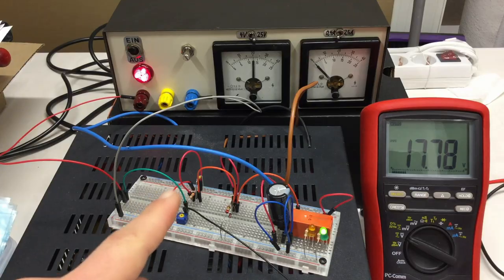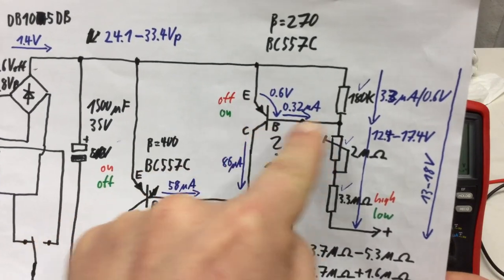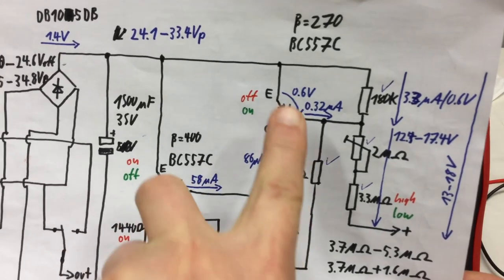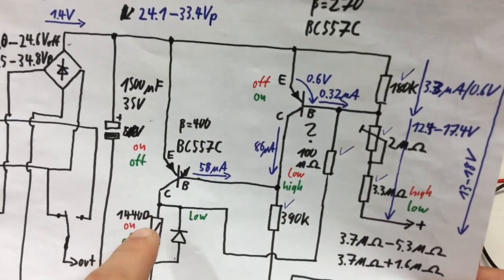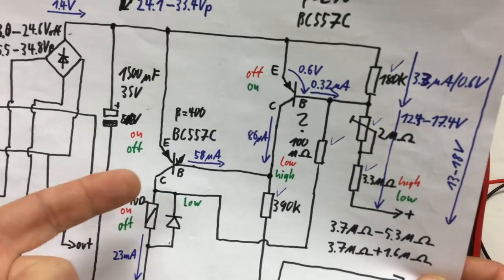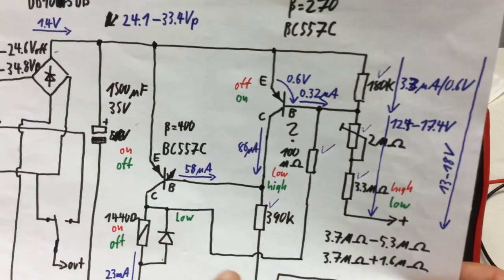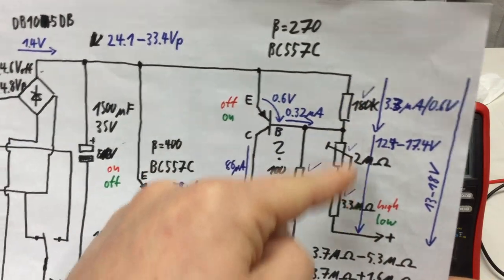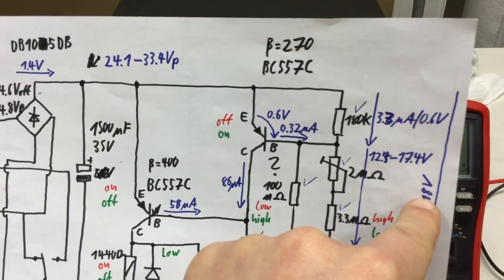The thing about these kinds of circuits is, of course, as soon as you are here at round about 0.6 volts, and I haven't put the feedback resistor in yet, you're in the nether regions, so neither fully off nor fully on, so our relay has a problem deciding whether it should switch on or off, because we are not really providing the necessary current. This will all change with the feedback resistor coming in, but I just wanted to see, without the feedback resistor, if our design values, which I calculated in the last part without thinking about the feedback, are okay. Currently I'm at 18 volts,